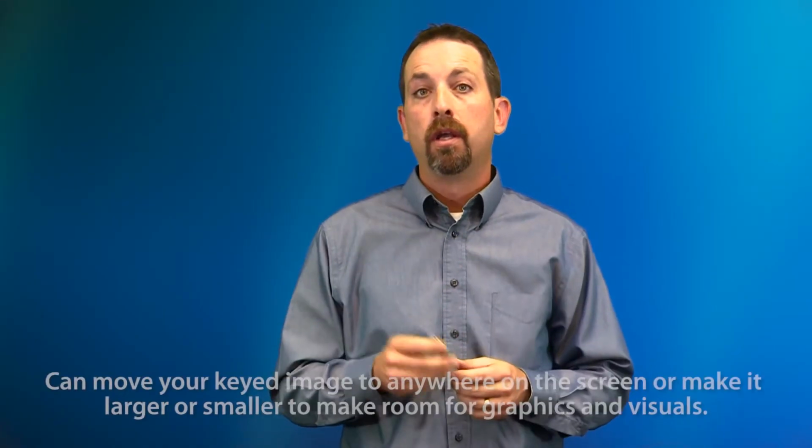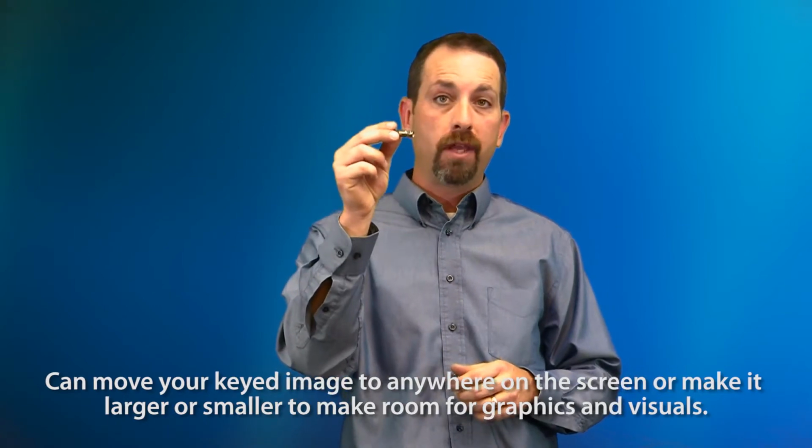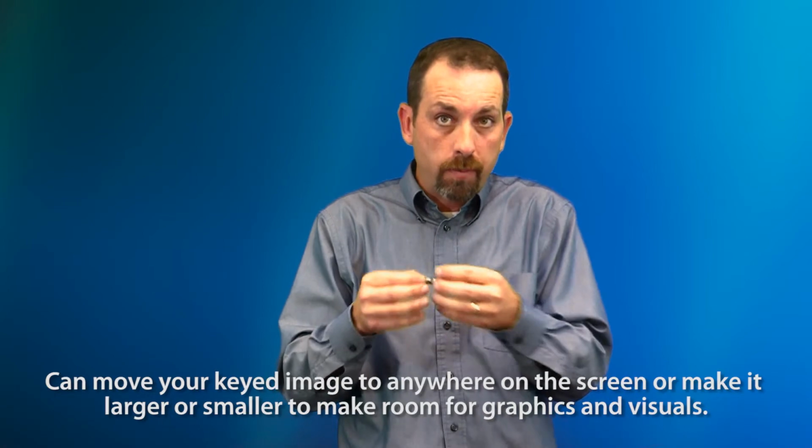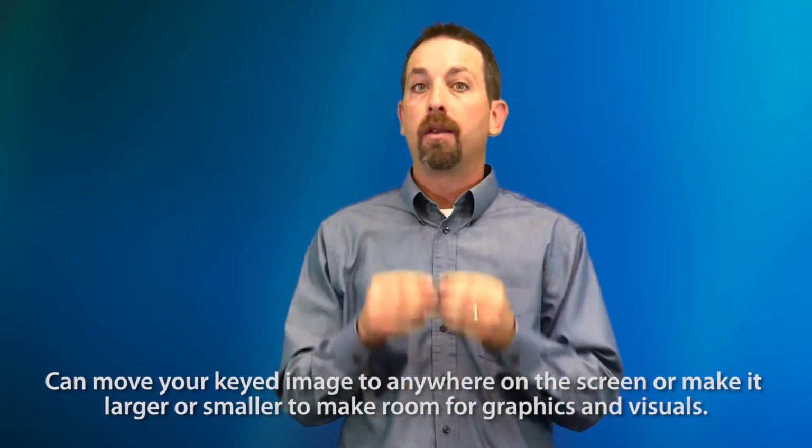We mentioned shielding. Shielding is probably the primary function of the F-connector. Its job is to keep all of our signals in where they're supposed to be and going where they're supposed to go, and make sure that those signals don't escape out. If they escape out, we call that egress. Egress is bad. The FCC does not like egress. We tend to operate on similar frequencies as airplanes. So if our cable signal is leaking out, that can be very, very destructive.